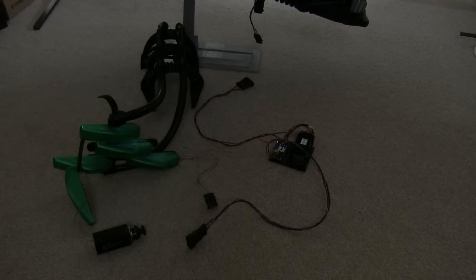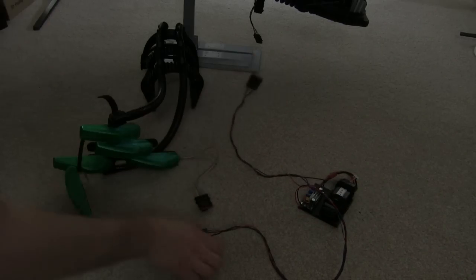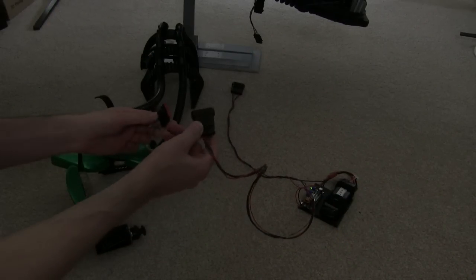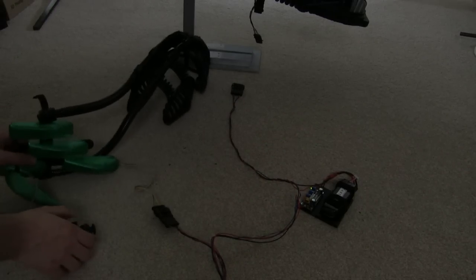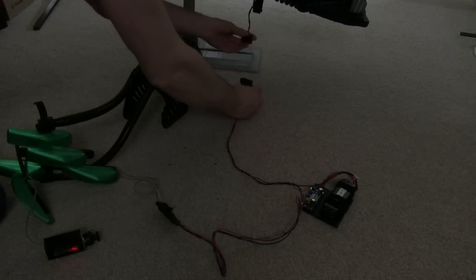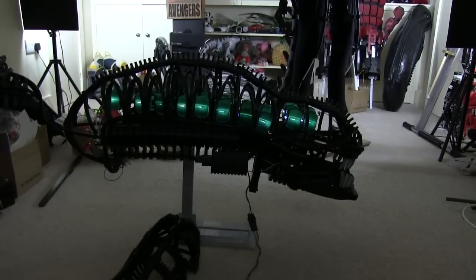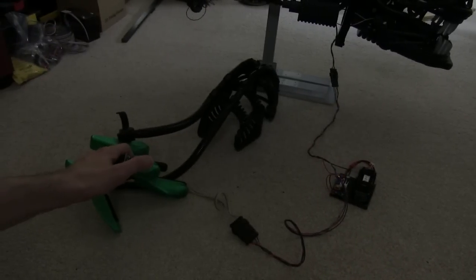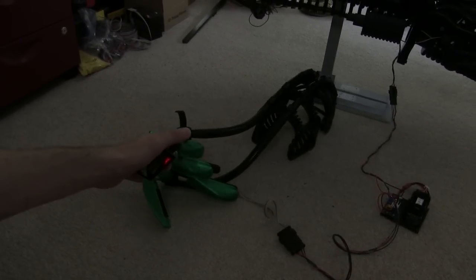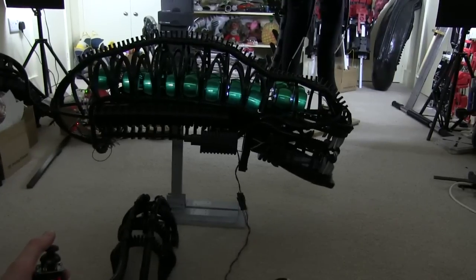So I've now got this modular system — you'll have to excuse it being slightly dark — but we're going to turn the lights on. I've got the power supply and the battery with the two connectors wired onto it. One of those goes into the arm, which takes I2C into the head, and that's got the hand controller. The other one goes into the head, which takes power up and the I2C for the animatronics. You should be able to see the lights in the head are now working. If I take my hand controller I can make those lights work, which will also control the NeoPixels in the rest of the suit, and if I flick my joystick it operates the animatronic jaw.